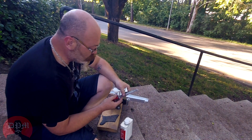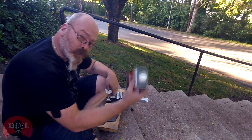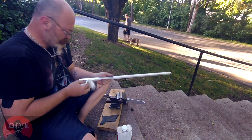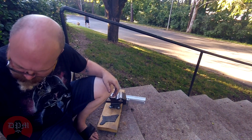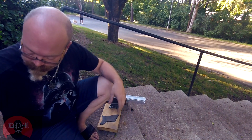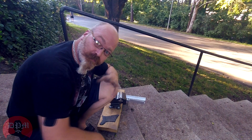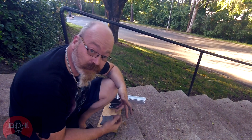Since I didn't have a wire brush, I went ahead and scored the ends with a file, and I'll wipe it down with acetone. There's quite a bit of dirt on that. The wire brush is supposed to remove the surface corrosion and prep the surface. The acetone is to clean those out.